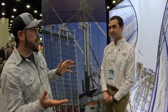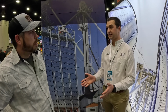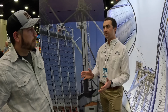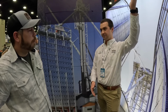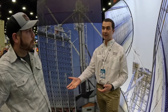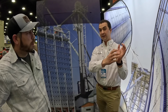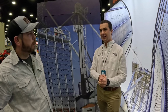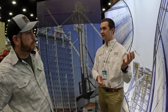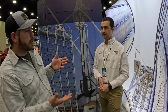Like you said, there's no right or wrong way to do it, so to speak. One of the disadvantages of fans on the side that we work through as an engineering team is now the motor is 20 feet in the air. Yep. So, it comes with the territory, right? We're gaining the flexibility. We're moving those fans off the ground to get away from any thermal risk. Yep. But at the same time, it's going to be a little more challenging to get that fan off that platform. Okay. So what did you do to combat that then?